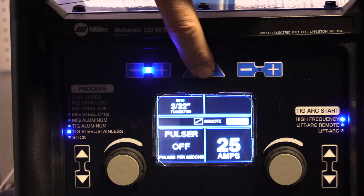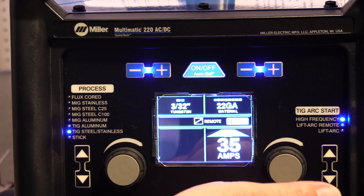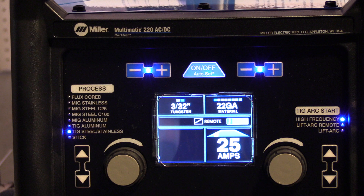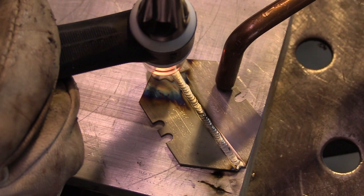I'm going to use about 25 amps for this box cutter blade. Another way to set amperage is to press the button that takes you into the auto set, where you basically just select your material thickness and it bumps your amperage down accordingly. So if I go all the way down to 22 gauge — as low as it goes on the auto set — it takes me down to 35 amps, but I want to set it manually at 25 amps. It's got a little bit of a snappy start on DC, so you won't be wanting to use this machine on 20 thousandths or below — it's going to be a little bit crisp on the start for that.